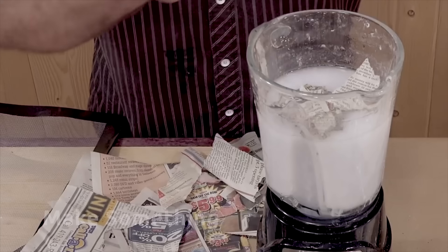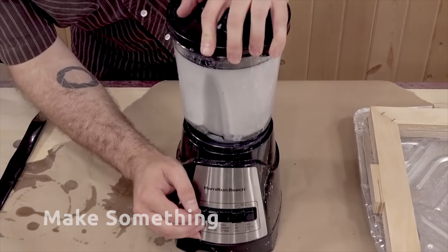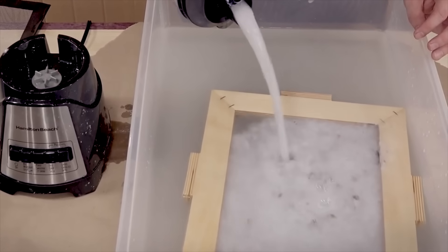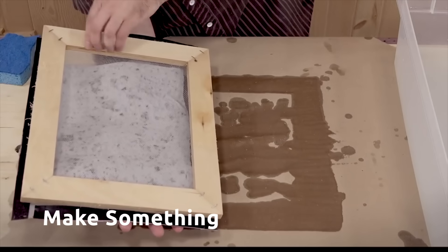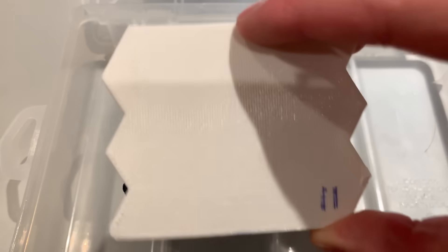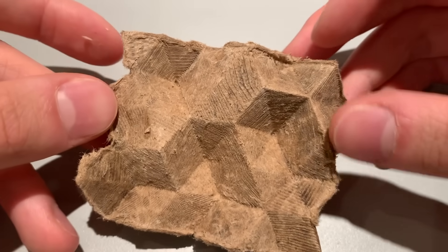Recycling generally works by separating the cellulose fibers in paper using water and physical processes — making a pulp. This pulp can then be used to make new paper products. It's a pretty simple process, as you can see from how many tutorials there are on DIY paper making. But the paper is always flat because it's formed on a mesh screen. This screen uses suction and gravity to pull the water out, leaving the flat fibers behind. However, if you instead form the pulp by compacting it, you can mold the paper into dense, three-dimensional objects.